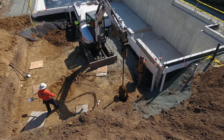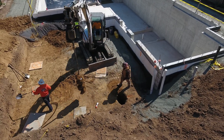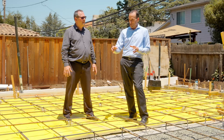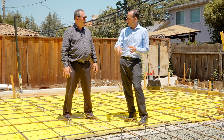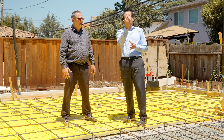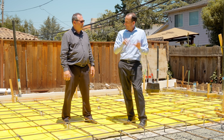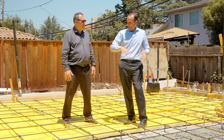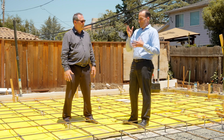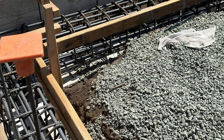In the overlay video we see a machine drilling the holes, and then the rebar cages were put down into those holes, sticking straight up out of the ground with a lot of extra rebar above grade. That rebar was tied into the grade beam, which is essentially a wide concrete beam that ties the many piers together.